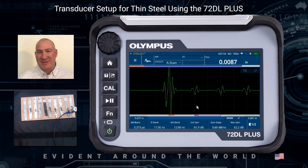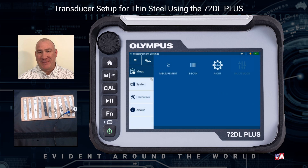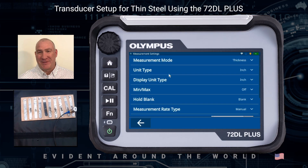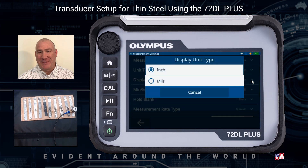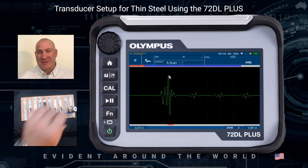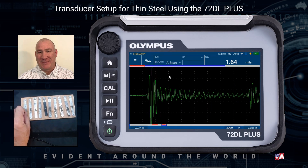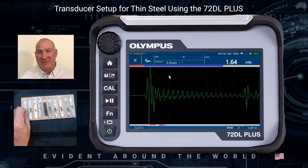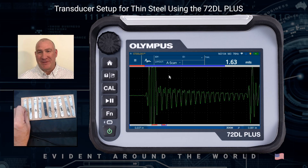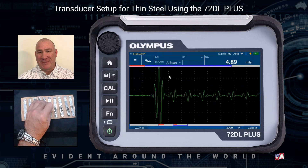To make it easier, I'm going to go into my setup and settings, go to measurements and units, and change my units to mils. Then I hit the home key under the knob to go back. Now I'm displaying my measurements in mils — you can see it's reading 8.73. This one is reading about 1.6, so it's off a little bit, and my 5 is reading pretty close to 5.